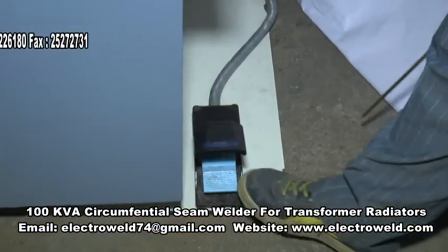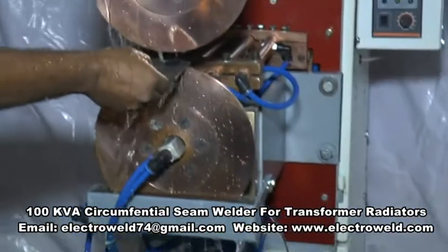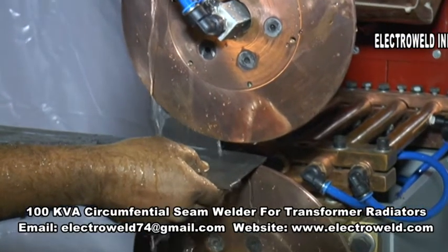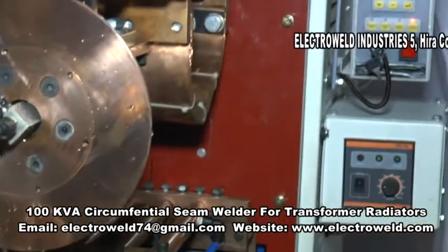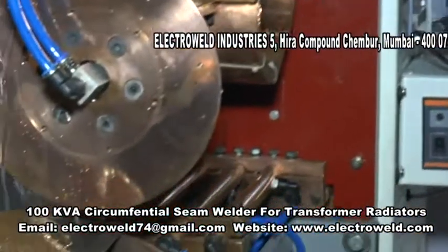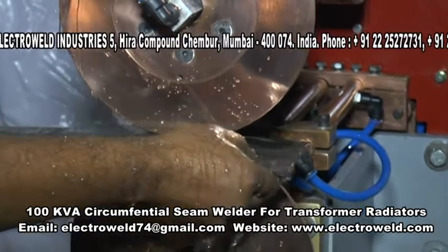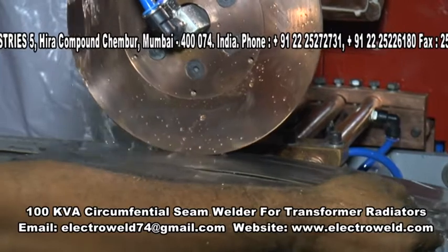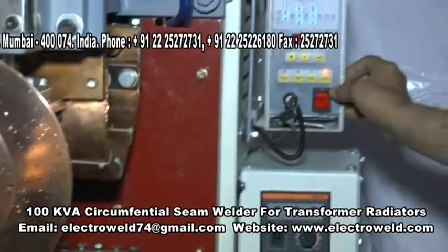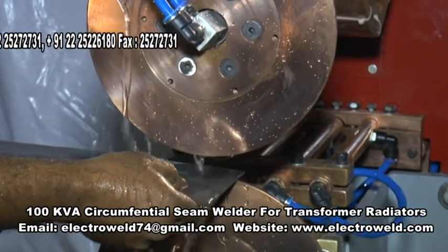This is for welding starting. Now we will start showing you the welding, after adjusting all the parameters as per the manual. You can first try this on no-weld by switching on this indicator, just to see how the wheels are moving — we will press the foot switch and just see how the wheels are moving. You can adjust the speed as per requirement. Now you can switch on the weld indicator and start welding. We will press the foot switch and just see how the welding takes place.